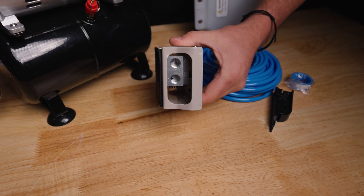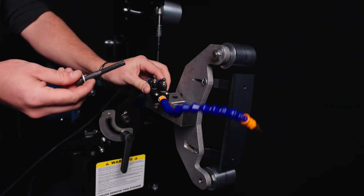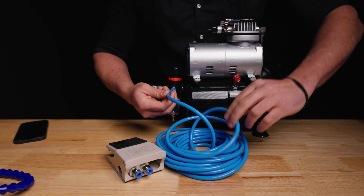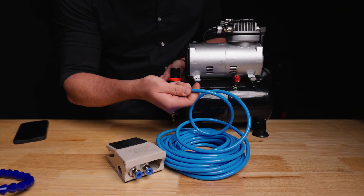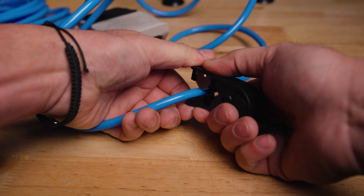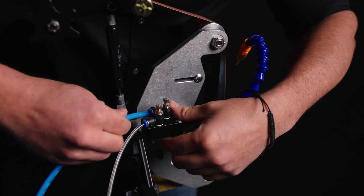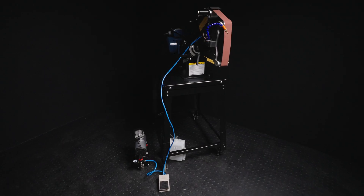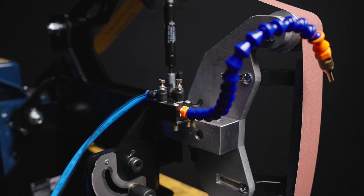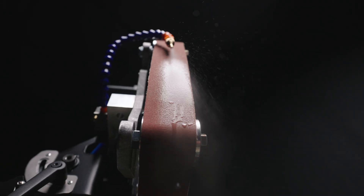Then we install the quick connect fittings into this foot pedal, then fit the flex nozzle to the tooling arm with an el cheapo bracket that we make. Finally, we measure out some air tube, cut to length, and connect it all together. We drop the feed for the sprayer into a water container — any container works. We like the ones from US Plastics. Mist cooling water when you need it, not making a mess everywhere when you don't.